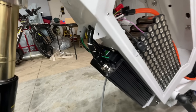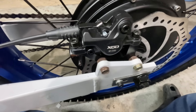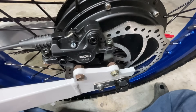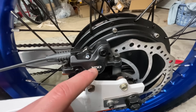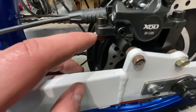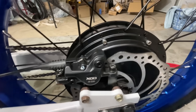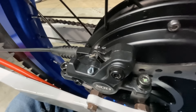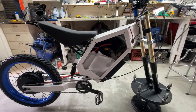I got the controller on and the wires hooked up, and it looks like the wires will barely be long enough to go around the battery. On the rear brakes, I had some extra spacers so I had to use longer bolts with nuts to space it out to match the brake disc. The caliper was way too far out and was only hitting about half the brake rotor, so I had to grind it a bunch. I just can't get it to work perfectly — right now it's on the whole disc but some tips of the brake rotor are still rubbing a pad no matter what I do. I'm going to call it good.